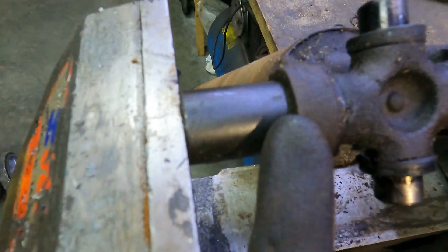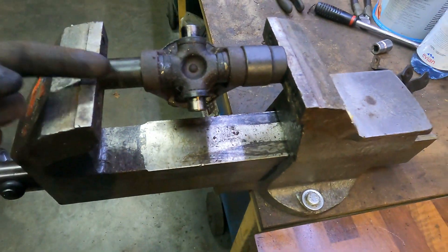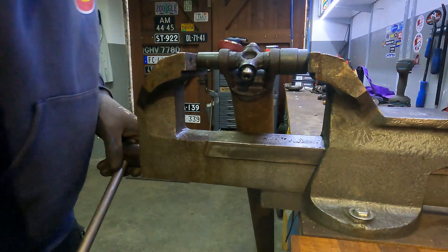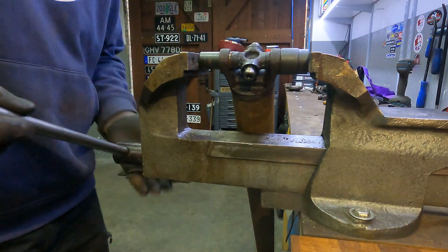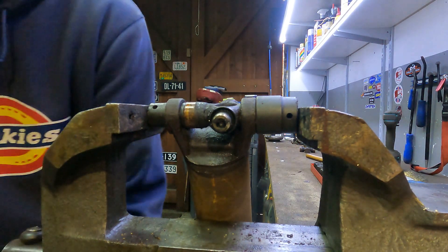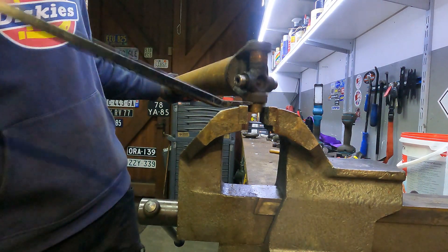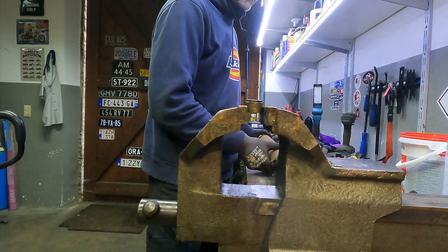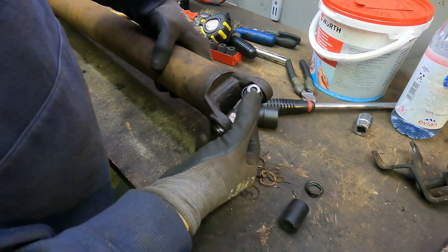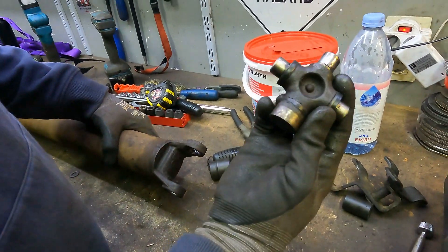You can see here — this socket fits inside of this, and this socket fits over the outside, so when I turn the vise, it will push this into there. There we go. If you just remove the dust cover, you can then just wiggle this out.